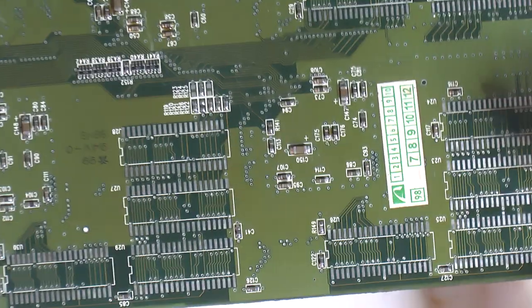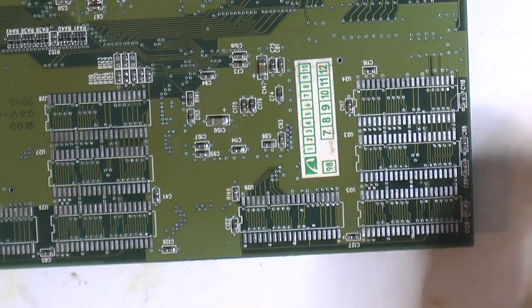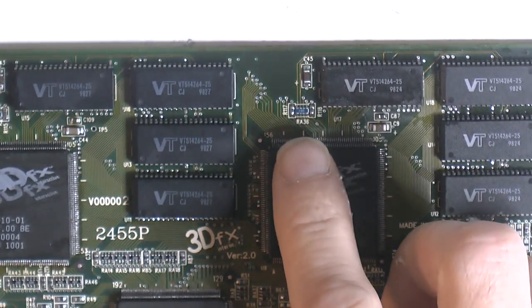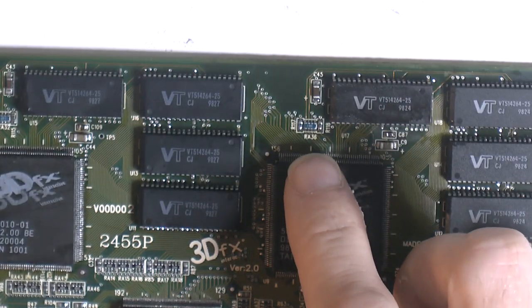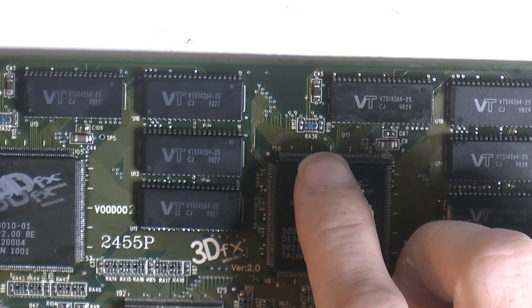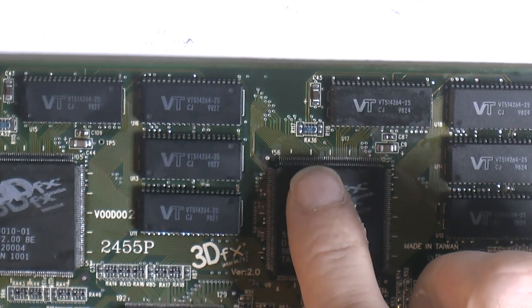let's see here, the pins over here, this row here, and they go over to this resistor array here. It's a blue one now. The original ones are black, and I have measured this. This is supposed to be 10 ohms, and the resistor array is just a bunch of resistors in one capsule, so they're not connected, but they are in parallel for space saving.